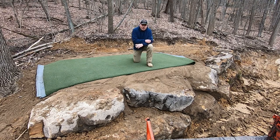So close — I'll have to pull this up, regrade it, compact it. This is definitely a temporary wintertime deal. I just want to get a shot off — that's all it boils down to. Once we've got some dry air conditions where I can work this better, I'll compact the sand, screed it out level, compact it — we'll actually put this down for real. For now it's just temporary. Let's hit a ball.